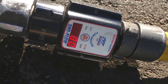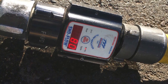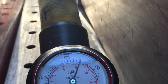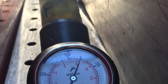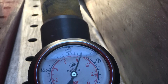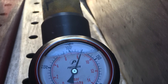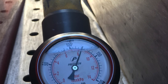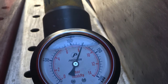You're likely to find that an automatic fog nozzle is reducing your flow by 10 to 20 percent. Just like fog nozzles, inline gauges and digital flow meters create a little bit of turbulence when making their readings — that's why we kept them out of our test. We don't have them at the discharge, and we do not have any inline gauges or other meters directly behind the nozzle, as that is an inaccurate way to get tip pressure. You really must invest in a handheld pitot gauge.